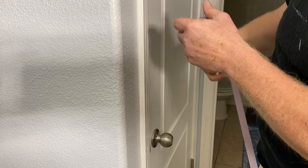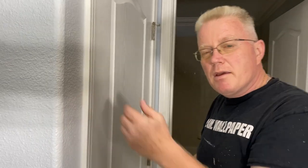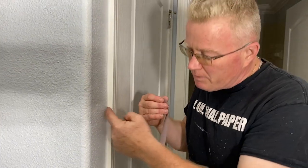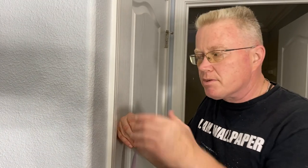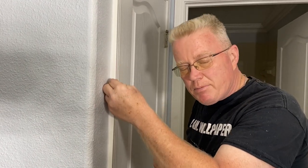A do-it-yourselfer might say, 'I don't care, just leave it as is.' But don't stop there — correct the line. We have yellow and we have this color here. This color was brought onto the trim because the previous painter left color there. So you have to bring your wall paint onto the trim if you want to make it look right. I'm going to show you how to make the line straight when you have to bring the paint from the wall onto the trim. All we're going to do is visually inspect the strip to see which is the greatest distance from the corner onto the trim where the error occurred. That will determine where I place my tape line.